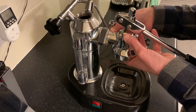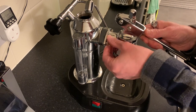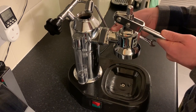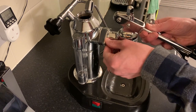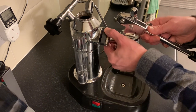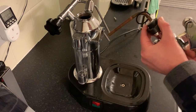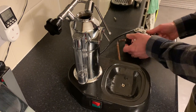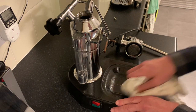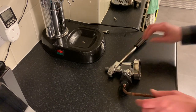After a few seconds those bolts will become loose. Your bolts will probably be shorter than mine because I've got the isolator on, so they're longer just to accommodate that. When you take this off you'll find the whole group head comes away, along with the siphon tube. I've actually had this off quite recently so the gaskets are not in bad condition at all. Now I've got the whole group head off, I'll just put the boiler unit back out of the way a little bit.